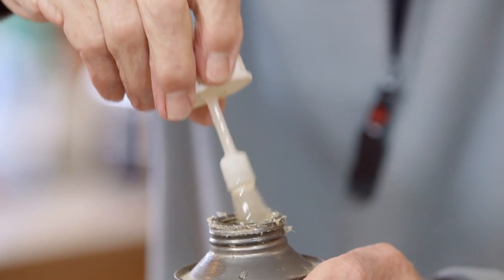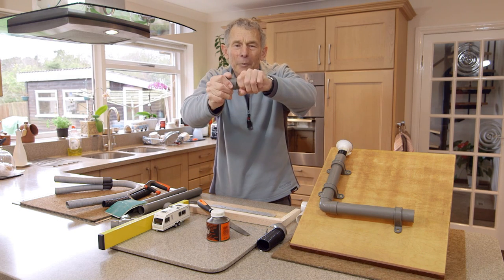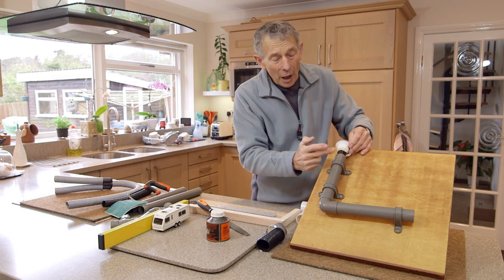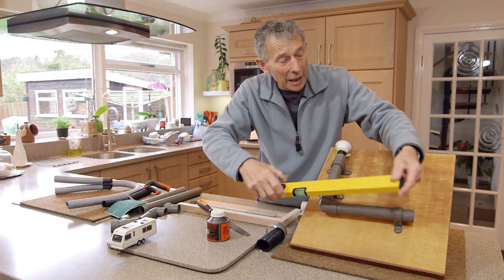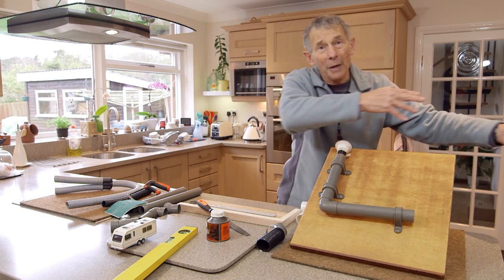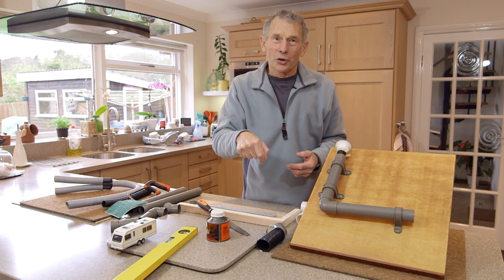You wipe the adhesive on, get the fitting, push it in, go back and forth a couple of times, and then leave it for 24 hours before you put water down it. So have a look — here at the sink end I've fitted these, mounted them firmly, and then going around the corner I want to check there's a slight slope. For the rest of the whole system there's a continuing slope, and if you can't get all the way through the cupboards, at least if you improve some of it and link it back up to flexible hose, you will get water whistling out of that sink a jolly sight quicker.